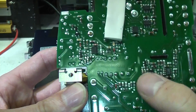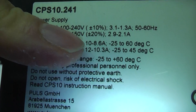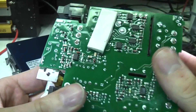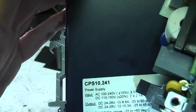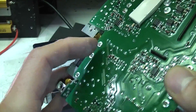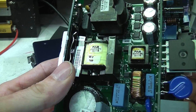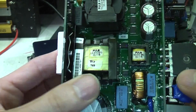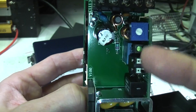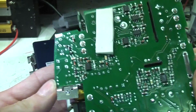One other slightly unusual thing — as well as running on the usual AC range of 100 to 240 volts, it's also specified to run on a DC supply. That's for systems where you want battery backup — instead of having a separate UPS, if you arrange battery supplies around that voltage you can switch the inputs over, using the same power supply whether running off AC or DC. That's probably more common in industrial applications. The other terminals are for a DCOK output — there's a little relay that gives you contact closure to indicate the supply is OK — and there's a trim range control on the front. Overall, quite a nice little unit from Pulse.